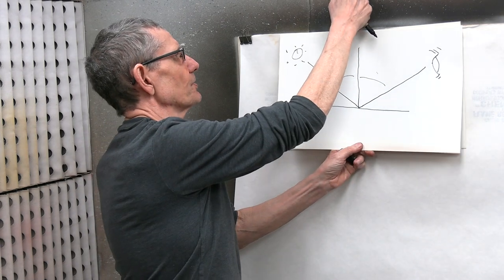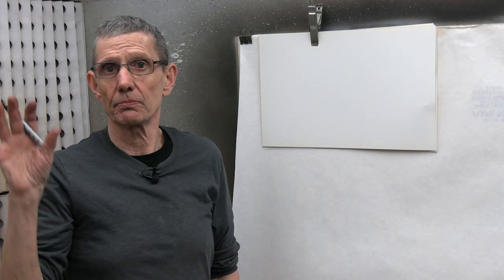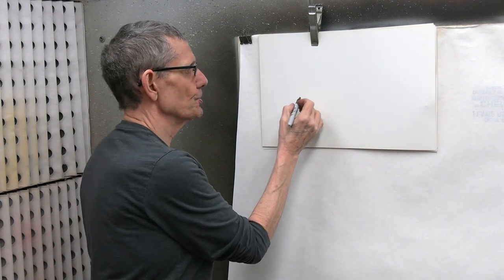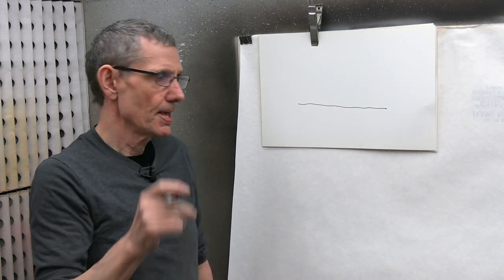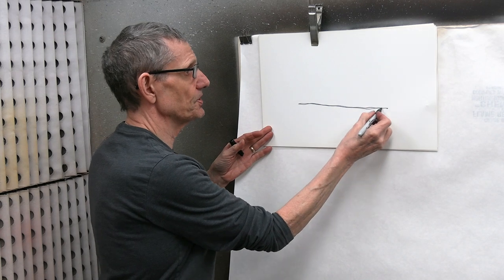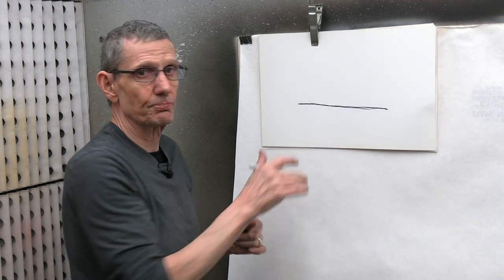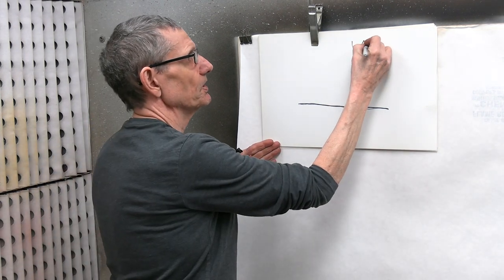Now, let's talk about the surface just a little bit. I don't care how great a finisher you are. If you're the world's best finisher with a spray gun, you will never get a perfect gloss or flat surface. The main thing to understand if you want a really good gloss surface is that you have to get this surface dead flat first. In other words, you have to remove all the texture from your spray gun, debris that might be in the finish, or anything like that. And you do that by first level sanding.